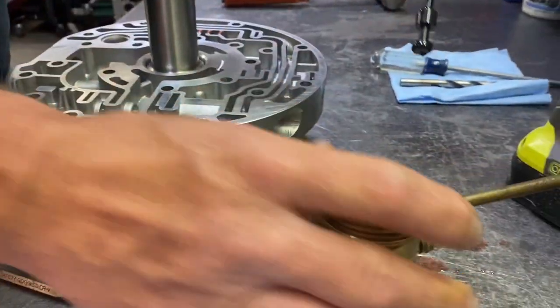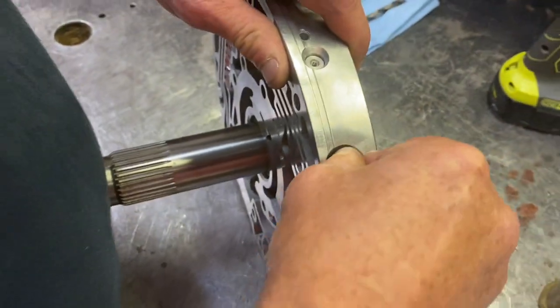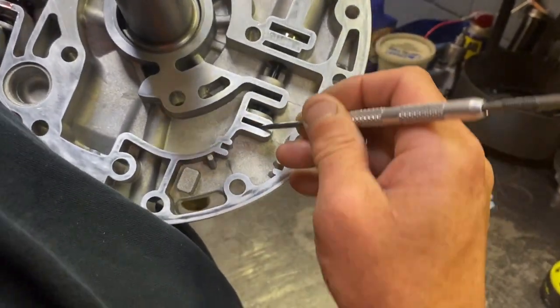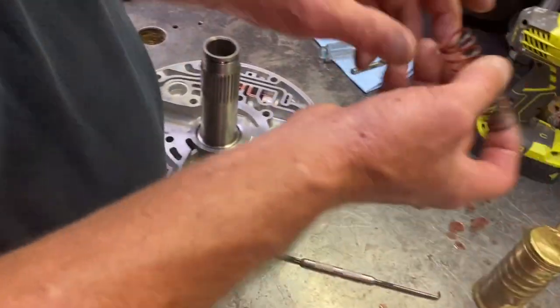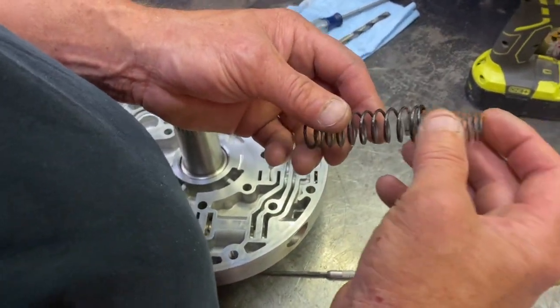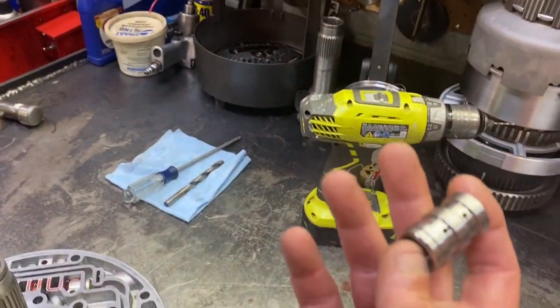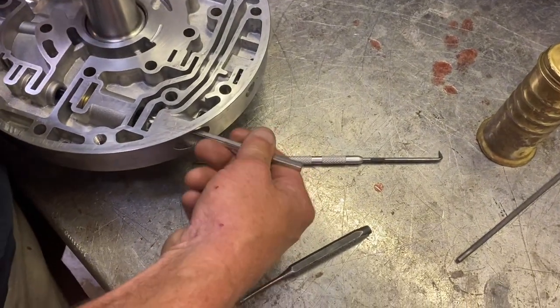And go ahead and get this thing in here, I suppose, without messing anything up. Got a lot going on with this valve spool here. Making sure it's nice and free. Falls right back down. No worries there. Both springs: the outer spring is basically just for your baseline pressure, and the inner spring is what gives you your boost from the boost valve. If you want to know more about that, the Hydraulics 101 explains that a lot deeper. But put a little juice in here, make the valve slide in easy.